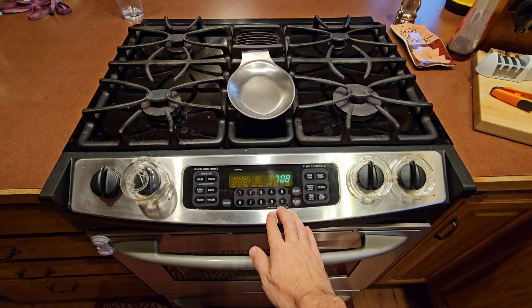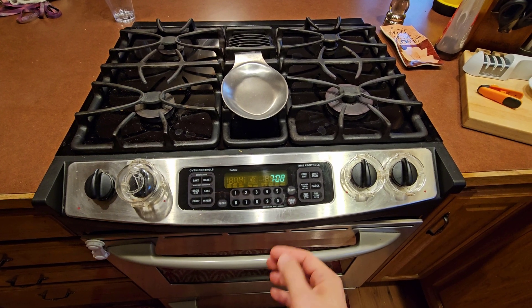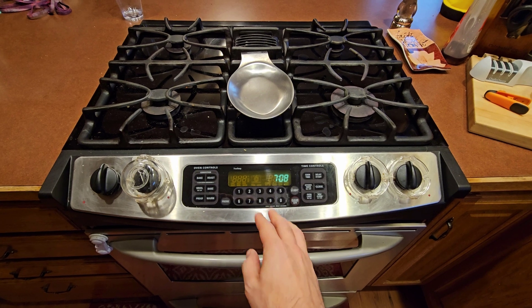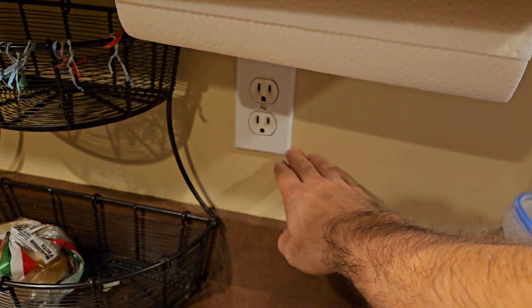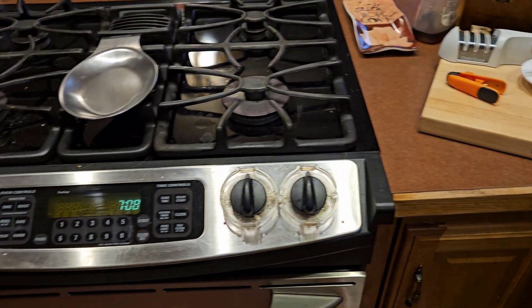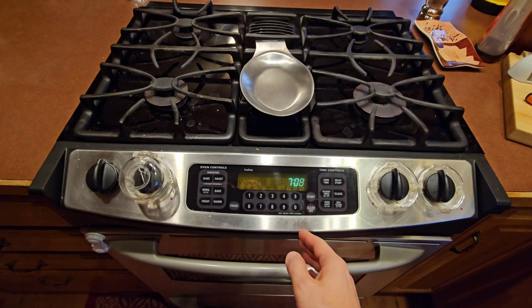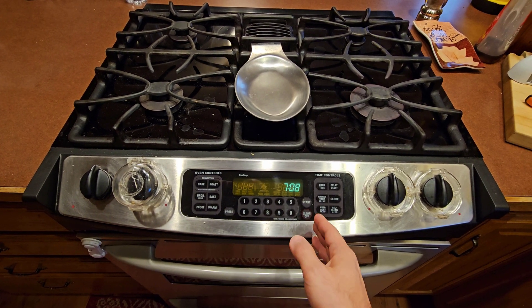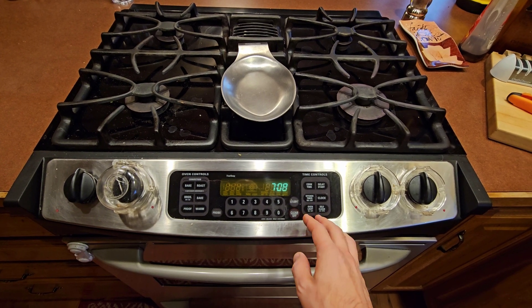We are going to be replacing a gas stove with an induction one. The problem with doing that is you can't necessarily just swap them out, because your gas stove is probably plugged into a normal 120-volt outlet on probably a 15-amp breaker — just the normal plugs you have all over your house. Induction and electric ranges require more power than that; they usually need a 240-volt plug on something like a 40 or 50-amp breaker, more similar to what you would plug a dryer into.